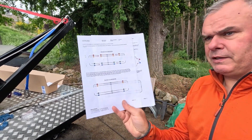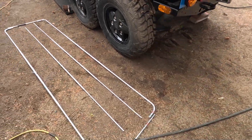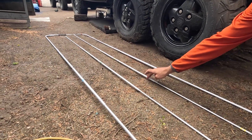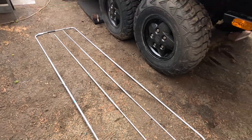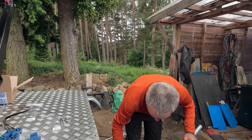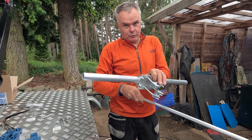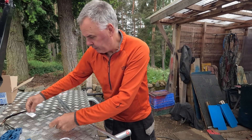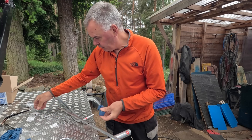The diagram is colour-coded as are the parts, so I've just laid them out on the ground — that's pretty much going to be the entire size of the antenna. You have a thicker piece in the centre in each case, and then a thinner piece that comes out each end, and they've all got holes in them so we can bolt them. We're going to start with A, which is the front. The hardware bags are helpfully divided: big bolts for the A and D sections in one bag, and B and C sections in a separate bag. That's been pretty well thought out.